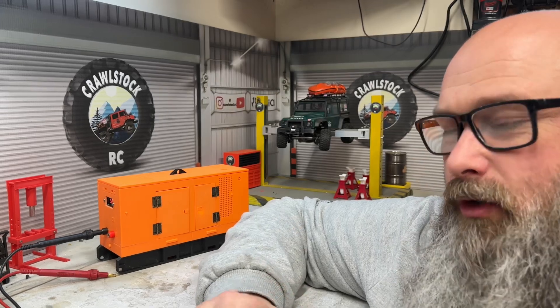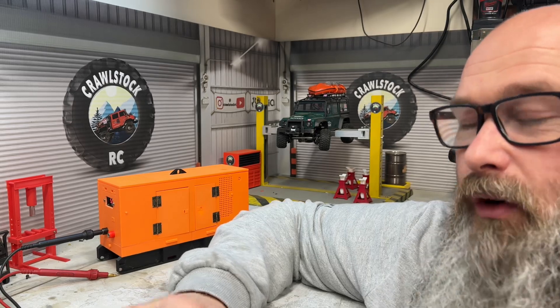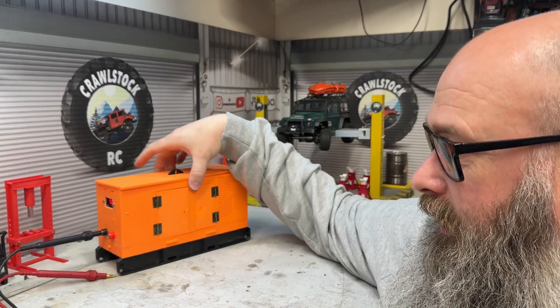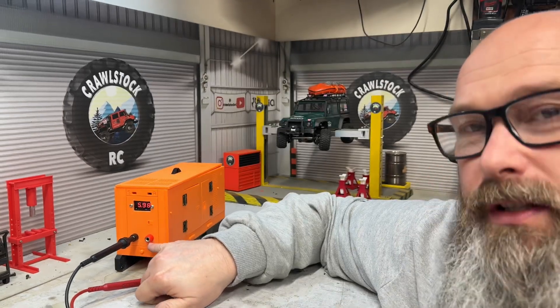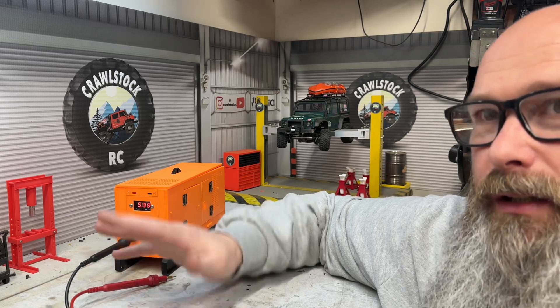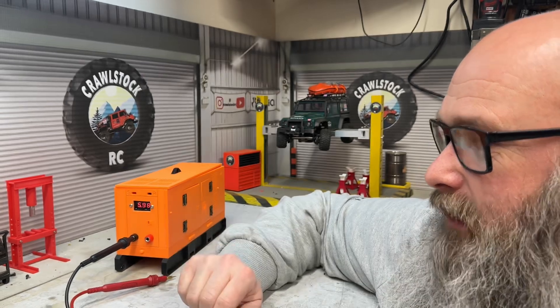So what we've got in here is a sound unit. I've got a BEC - a battery elimination circuit - which is basically a voltage regulator reducing everything down to six volts, because some of the electronics in here can only run on six volts. That's powering everything. We've also got a voltmeter on the end here, and I thought it'd be fun to put a set of banana connectors on the end so I could power something from it - maybe a set of street lights, which would look pretty cool.